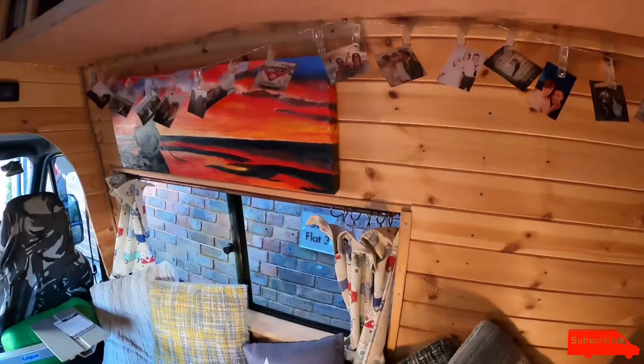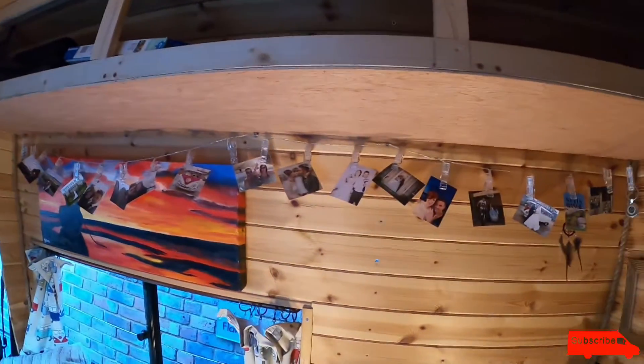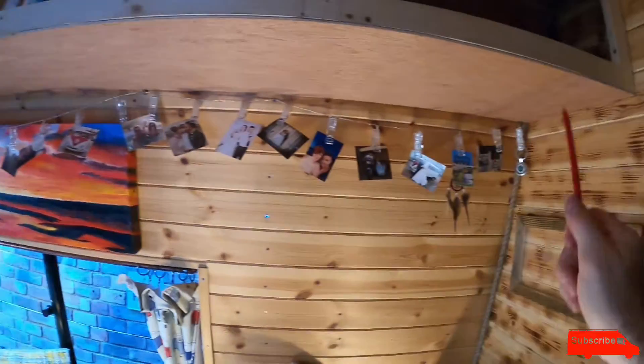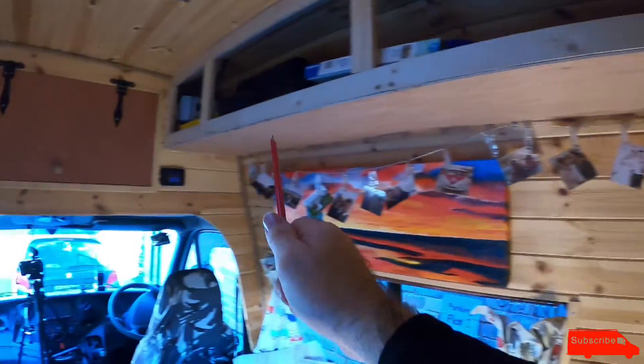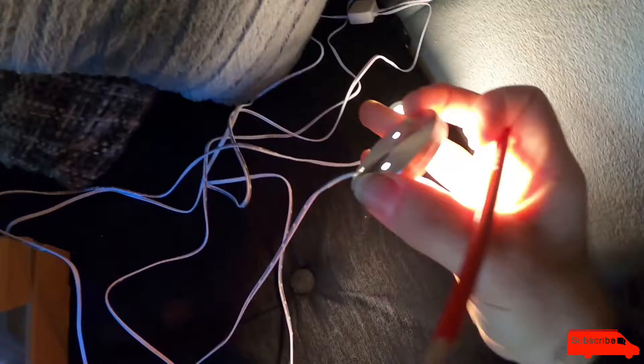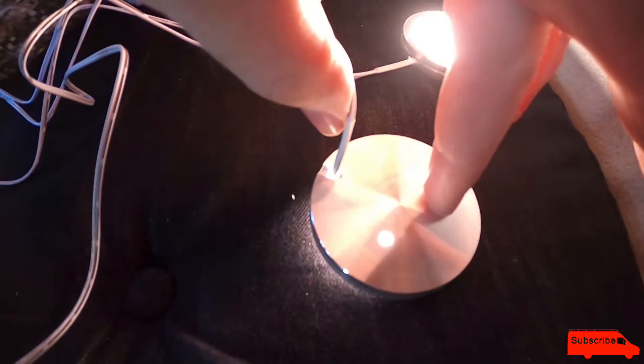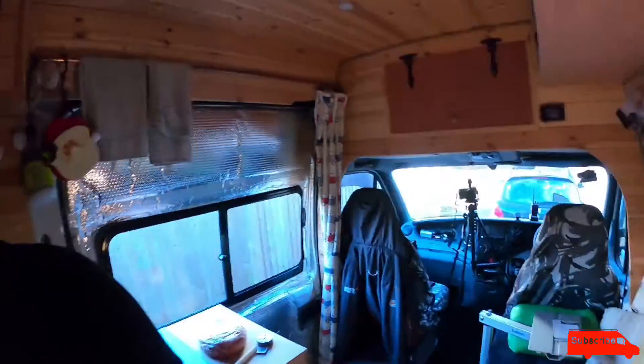Just need to measure up and make sure they're all spaced evenly. For under here I'm going to have two lights. I thought about having them spaced evenly but it just didn't look quite right, so I'm going to go 50 centimetres along from this wall, 50 centimetres along from that wall, and then obviously central. I've made my first marks - marked 50 centimetres, that's where the start of the light is, and I've marked all the way around so I know exactly where it's going to go. With these lights the cable on the back has a mark too, so I've marked for the cable. These are six centimetres wide, so a six centimetre circle, and I've made a mark for the cable to go through.